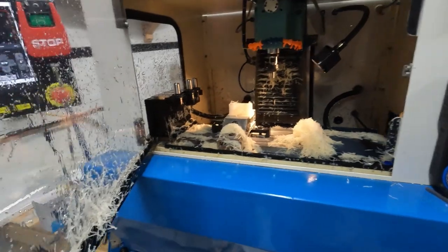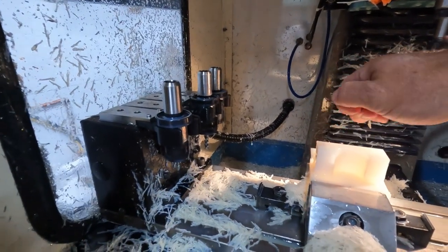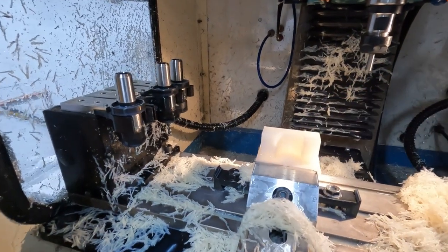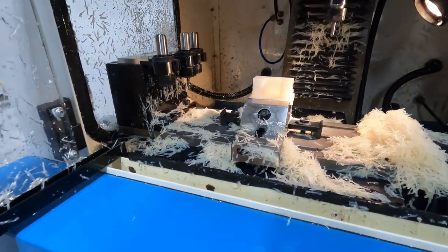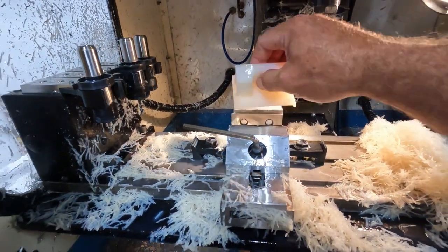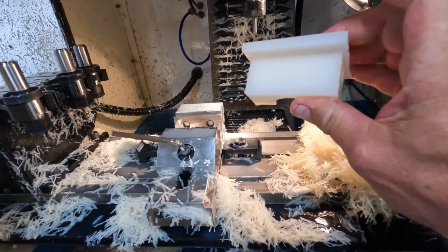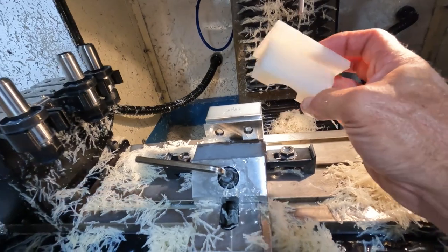This is a really fast chamfer cycle. You can see the material just basically falling off. That's the finished part — there's a nice chamfer on the edge. There are some little fuzzies but this is plastic, so it's hard to avoid entirely. That 9/16th end mill could be a bit worn. That's number two done — ready to go. Hopefully you can see the nice surface finish in there.